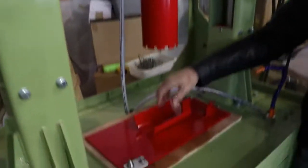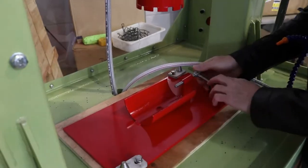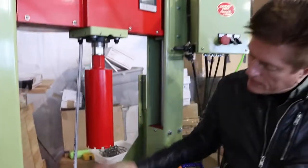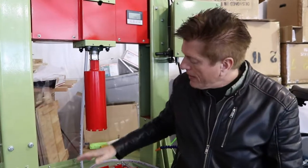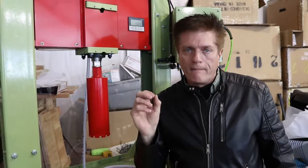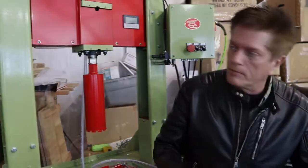And then once you do your first drill, this little pin here sets the distance of my preform, and you'll set this up when you configure your drill. There's a configuration process where you center your jigs, making sure your jig's all there, and that's a separate video I'll do. But basically, the cross drill jig then allows me to do each cut. Do my first cut, turn it, do my second cut, turn it, do my third cut, so I can cut all the edges off. The jig is really the magic of being able to take this core drill and very rapidly make your preforms simple, real quick, 2-3 minutes most of grinding, and then you're into your sphere machine.